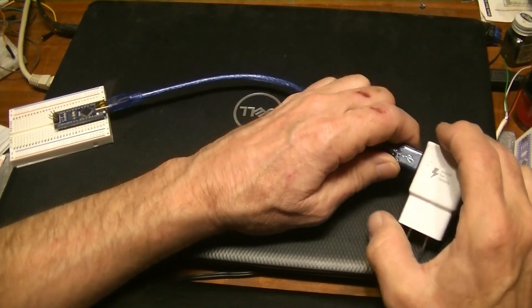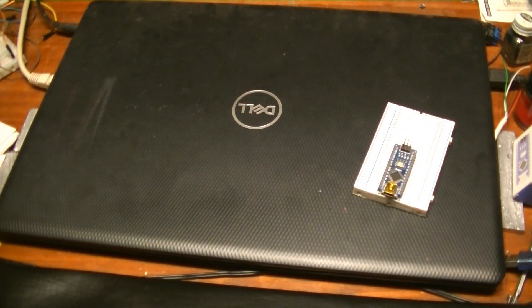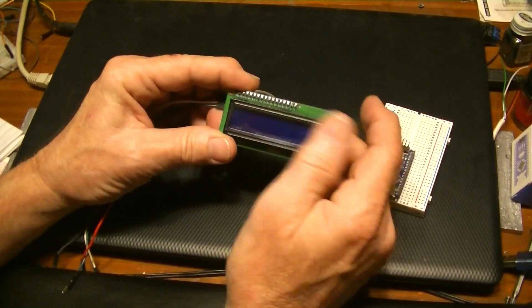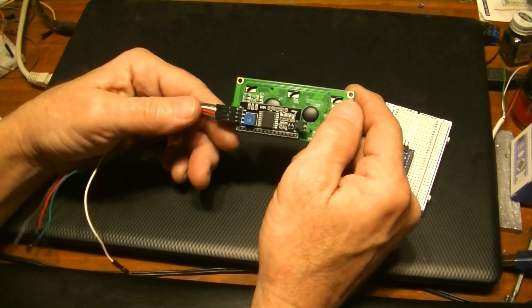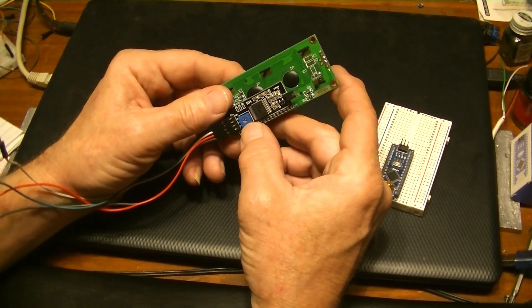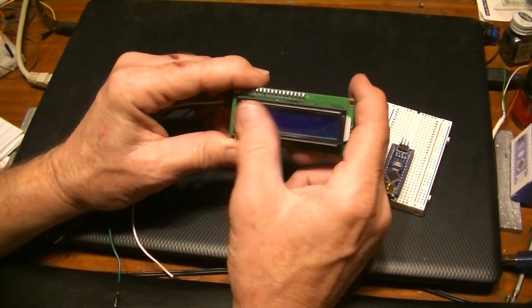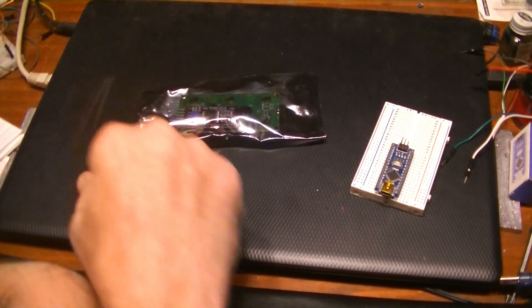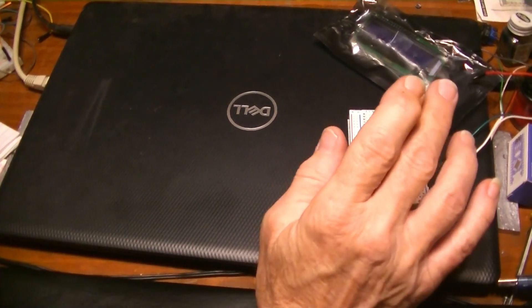I use wire cut to any length I want, keeping red-black pairs. I always try to save one cable for programming. For the display you're going to need one of these — a 16 by 2 LCD display. This potentiometer here is very important: when you first plug it in you'll just see white, but turn it down a little and your display will come out.